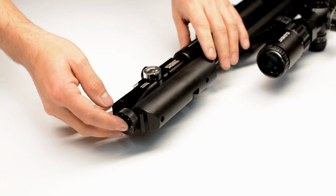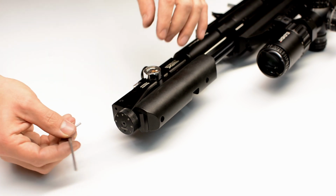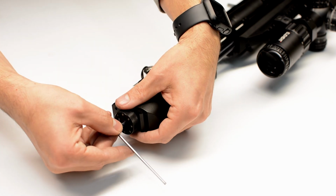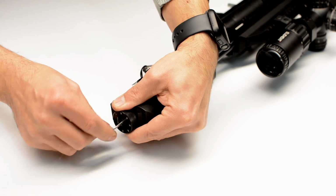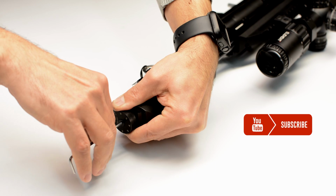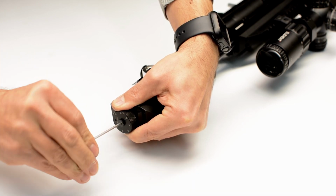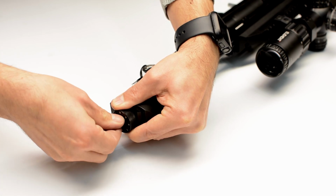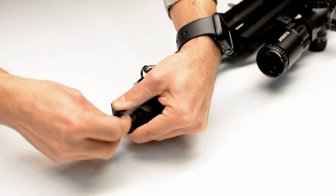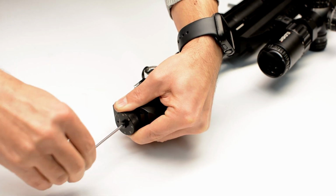Now, to remove the power wheel, it's very simple. You have 1 screw in the middle. Take the correct Allen key. I always like to put it with the adjustment hole down, so I know exactly how to put my wheel back. Hold the wheel tight. Be careful, there's a small ball bearing behind the wheel, that you don't lose that one when taking off the power wheel. A little bit difficult to do on camera, making sure you can see everything nicely.